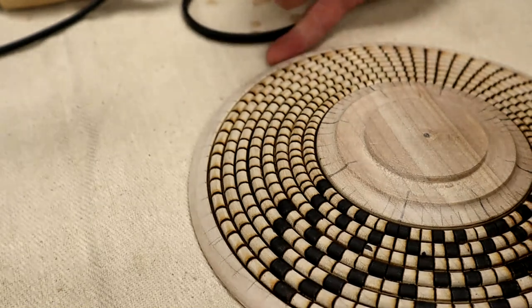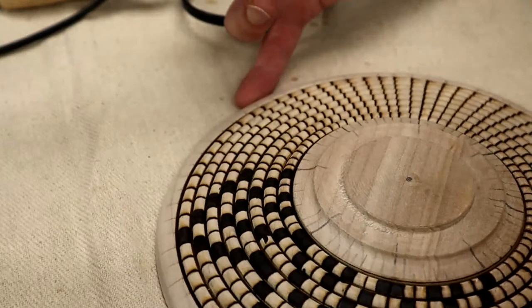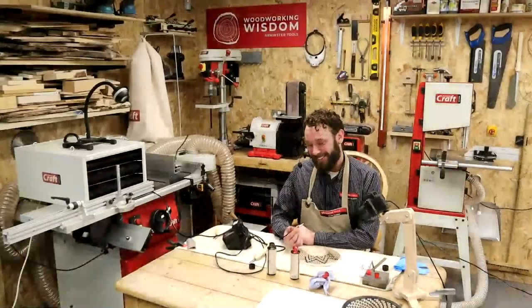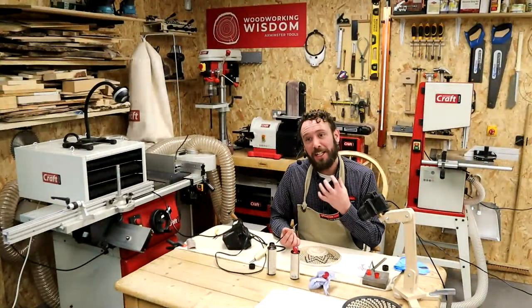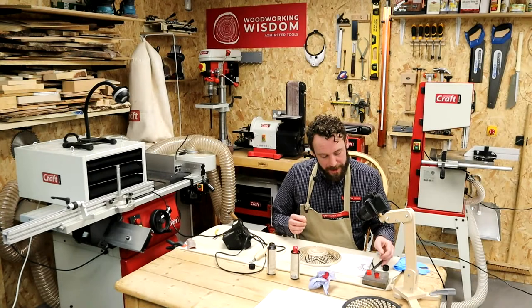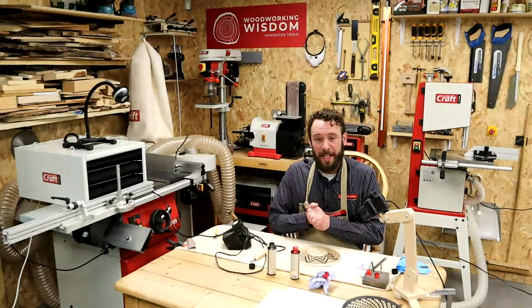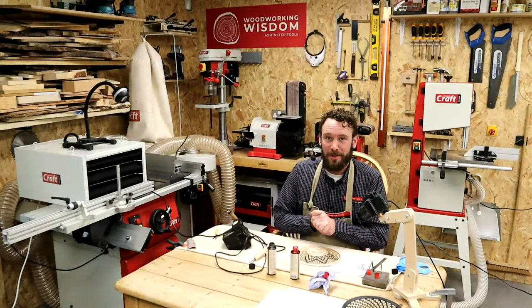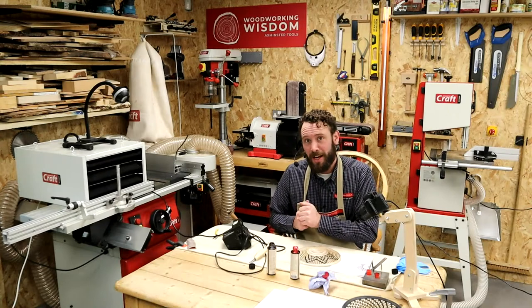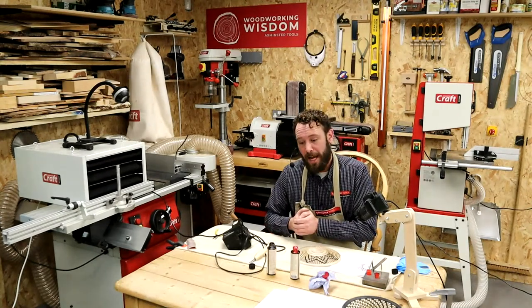We've got one from Jim. He's asked, if you did make a mistake and colour the wrong square, how can you fix it? You can't really with these stains. They really kind of penetrate in. What I was thinking, it'd probably be better to go in with the red first. And then if we do make a mistake, if we colour the wrong square, we can always colour it black. And then the black's going to sit on top of the red and hide it a bit better, where the red won't sit on top of the black.